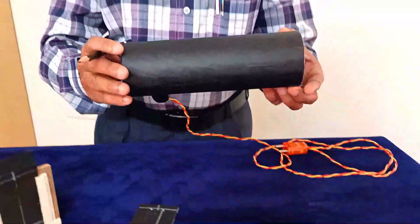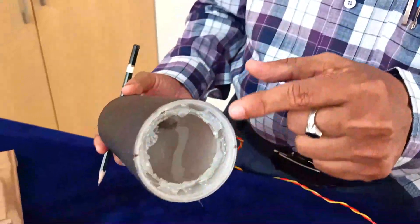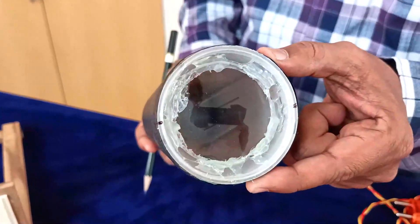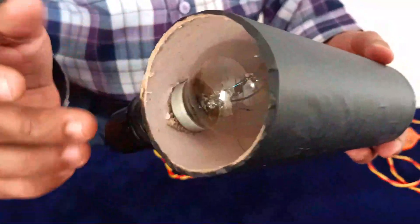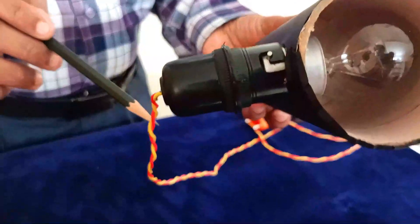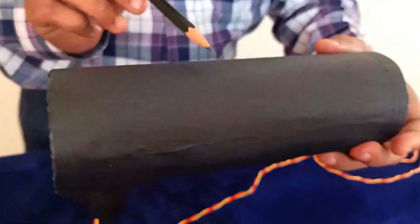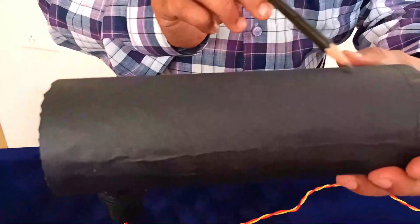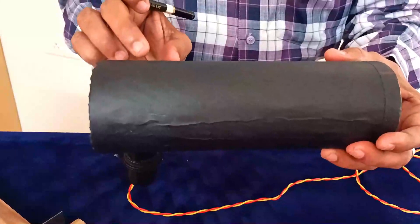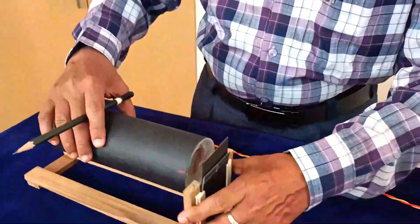I have taken a shuttlecock barrel, which is freely available. Its original length is around 34 centimeters but I have cut it to 20 centimeters. I fixed a 15-centimeter focal length convex lens at one end of the barrel using glue gum, and at the other end I fixed a 15-watt filament bulb with a holder and connecting wire. The filament must be placed exactly at the focal length of the convex lens — here it is at exactly 15.3 centimeters. The barrel is then placed on the wooden stand, and this is our parallel rays producer.